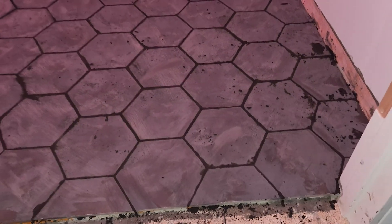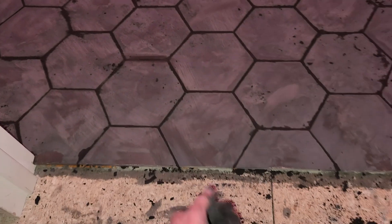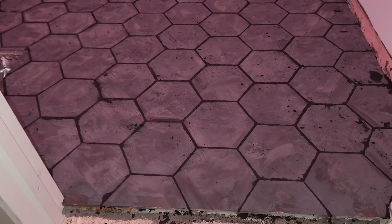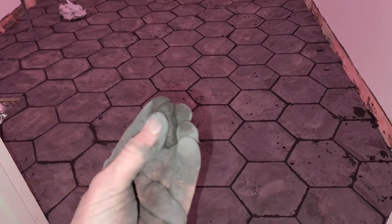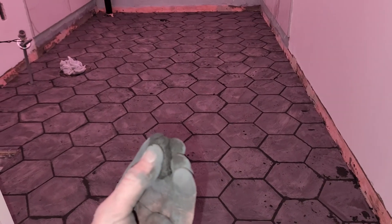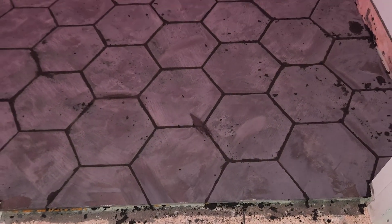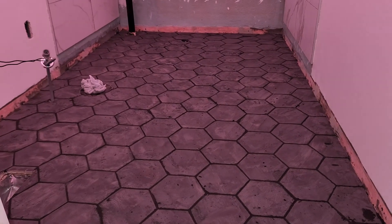That's why I didn't use the whole bag — put a little grout in a Ziploc bag to keep it moist. After we wash, if we have any spots we missed, we can wipe grout in with our thumb and clean it off. Go ahead and take a small clump, put it in a plastic bag, wash your float, and let's get to wash number one. I've got some warm water and a nice sponge — switched to a new one since the old one was flaking. Wring the sponge out so it's damp but no drops — we don't want water sitting in our grout lines.